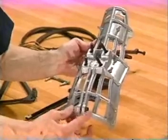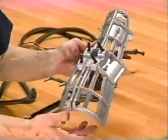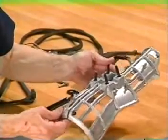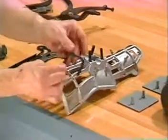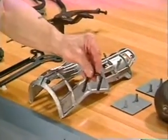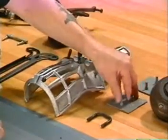No rubber washer, but we still have an adjustment screw in order to get the proper spacing between the forward tips of the cups. The cups are held in position by 2 U-bolts. We use these U-bolts then to position the cup in order to put the pin on spot.